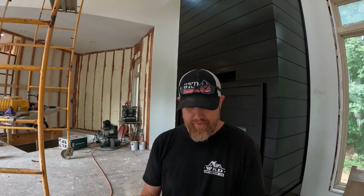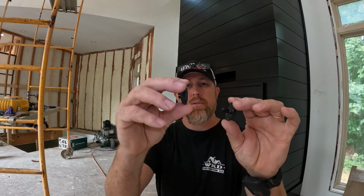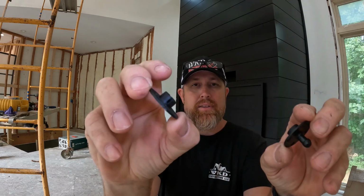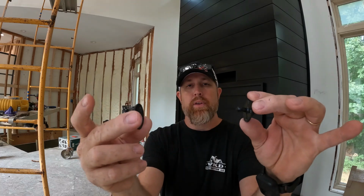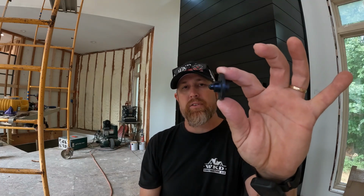So I was just going online trying to find something that could be a hidden type fastener, and I think I found it. I believe it's called a Beau clip, B-E-A-U clip, and it's made for panels basically. Just got a male, got a female. Recess this with the Forstner bit on the back side, a little 1/2 inch hole, and then once you screw this to one side, this to the other, it actually just mates and makes a really nice tight connection, and it's hidden.